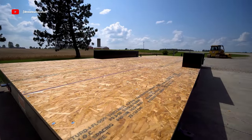Okay, so real quick before we move on, I just bought another window from Home Depot that has one of these nailing fins, and I'm just gonna show you how to install it really quickly so that this video pertains to everybody. So with my window opening, I flashed it the same way I did the other window, just minus those two strips of vertical flashing along the two sides that I don't need with this window. I did the same thing blocking the bottom and making sure it was level.